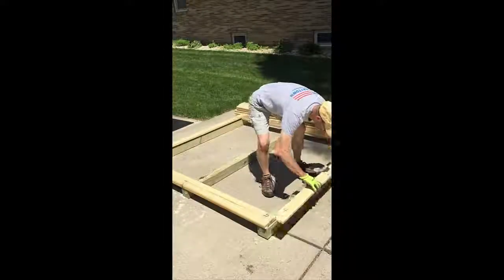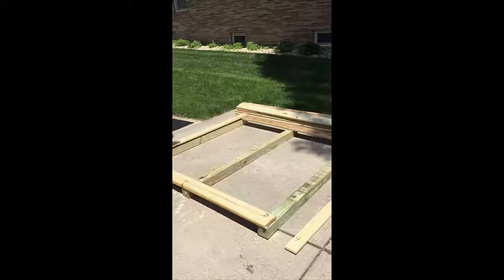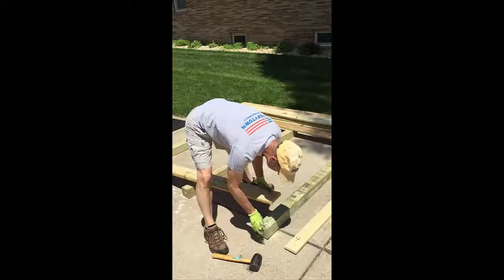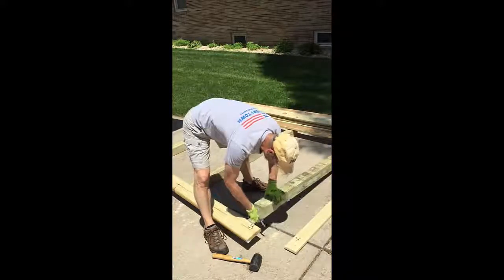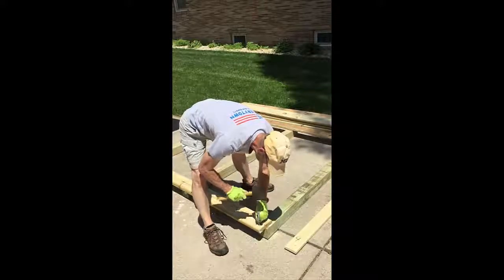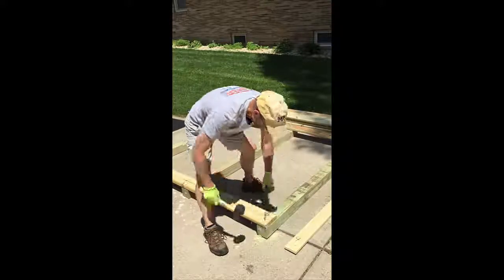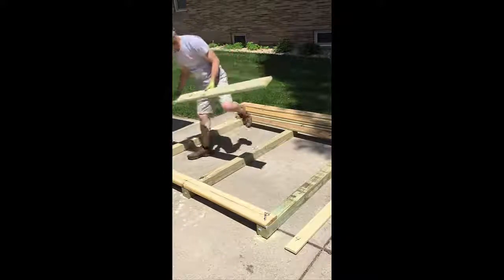Once the holes are drilled, I laid my 1x4 boards aside and put bolts in the holes at both ends of the deck board at the edge of the stage. The holes were full of shavings, but I only need to make sure the bolts go into this 4x4. I'll drill all the way through the base later. After that, it's just a matter of laying the rest of the boards side by side.